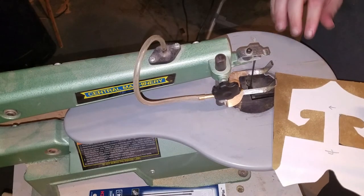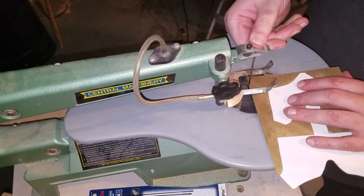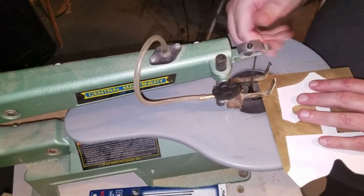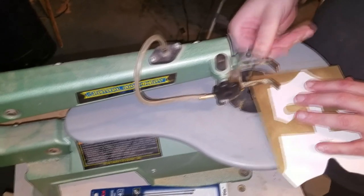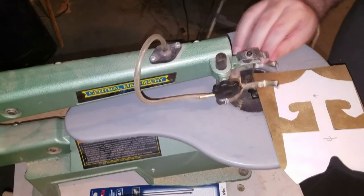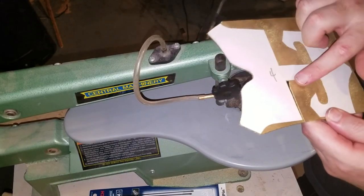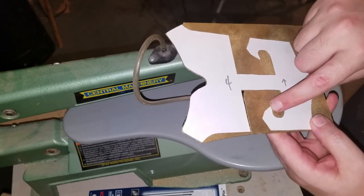Here's another thing. You start cutting, this blade will take off with your piece. It will pull it all the way up to this. This is what this sled is for, to prevent that from happening. But you'll get dancing. It'll rise and lower with the arm. You're pressing too hard. Draw back a little bit. Okay, that's enough lessons on there. We'll get to actual cutting philosophy in just a second while I finish up these three lines right here.